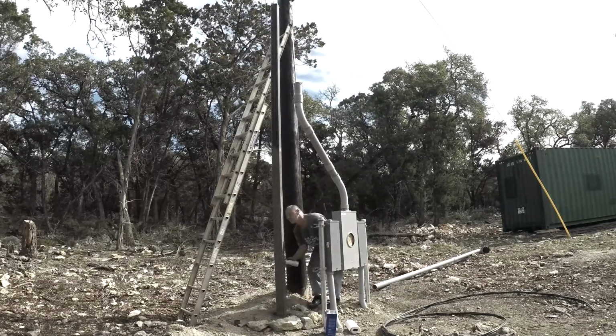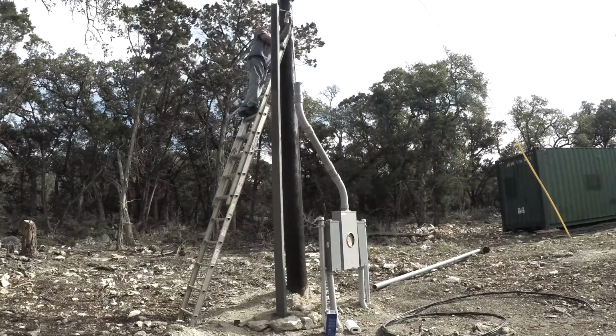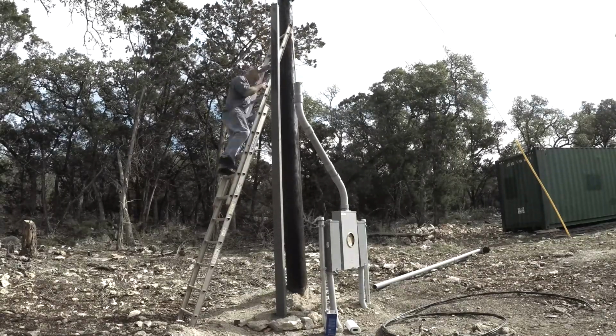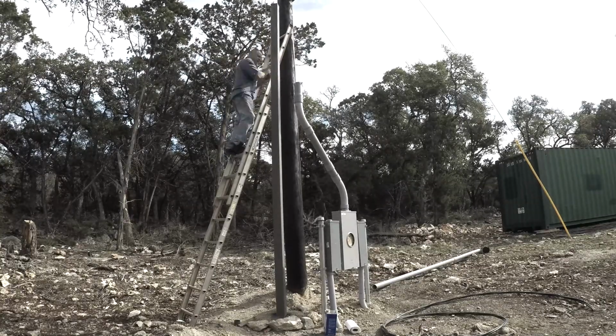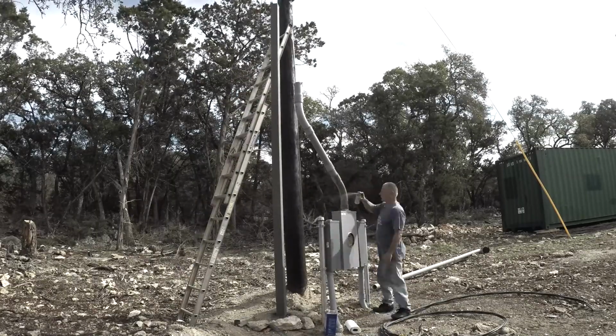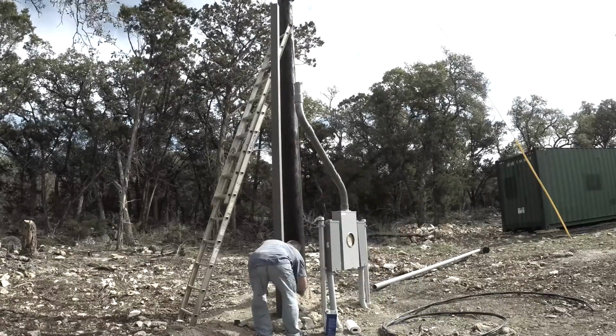It's steel, so I primed it, painted it, and then attached all the PVC stuff, and then fed the wires through it, and then wired it into the meter stand with the leftover wire hanging out of the weatherhead. The PEC guys want like 3 feet hanging from the weatherhead. I had the pre-cut wire, so I just left the whole thing hanging there. Pretty much touches the ground, but I'm sure they might appreciate that.